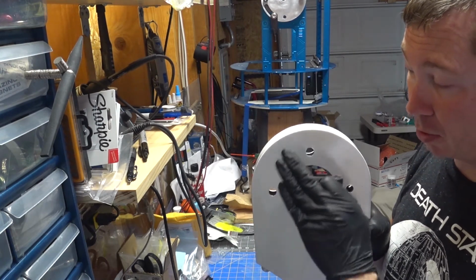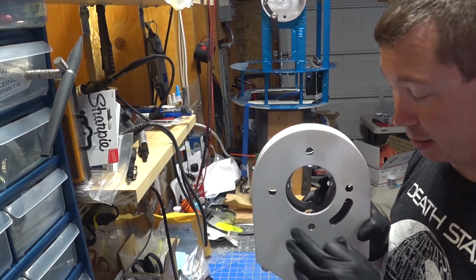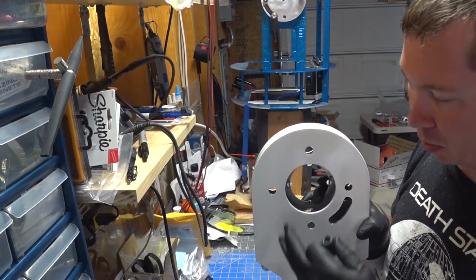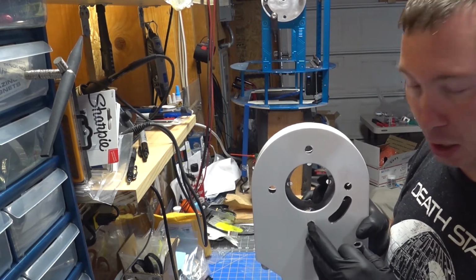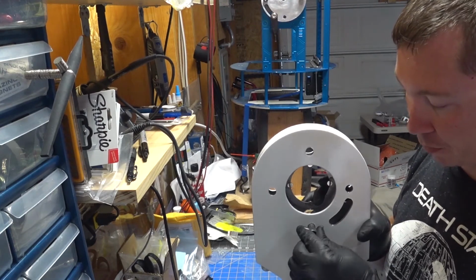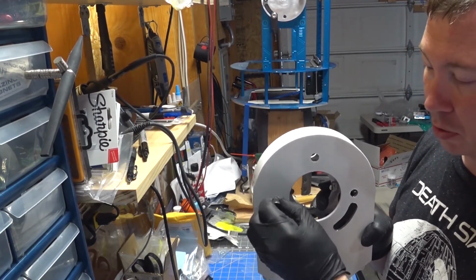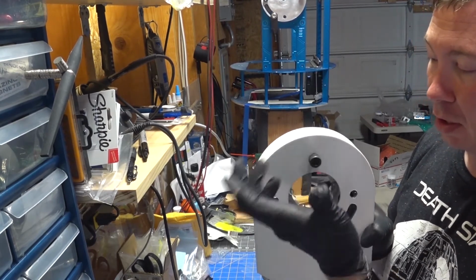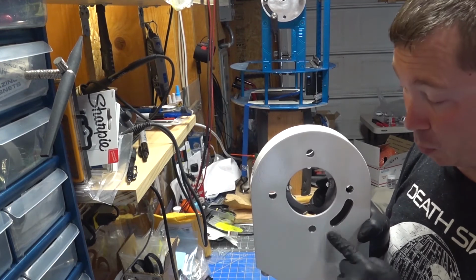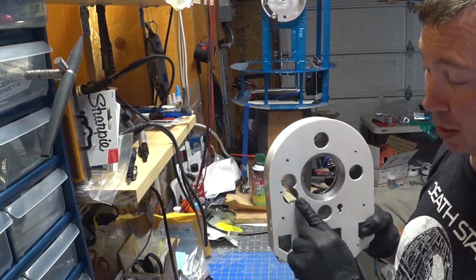Really what it comes down to is because I did automotive painting, I did not mask off the insides of these holes. So some of the base gray primer, and then going into the white coat, and then a little clear coat made it down there. So it made it just a little bit more snug. Now, as you can see, it goes into the holes with little to no effort, which will be fine for connecting. So perfect. So that's done. We did both legs. Both the bolt holes as well as the attachment hole.